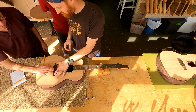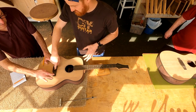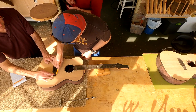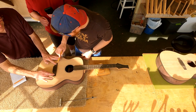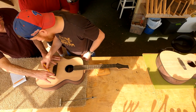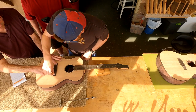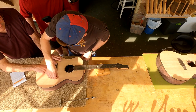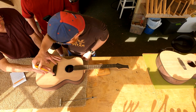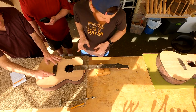And go ahead and hold it at the wings now. Like that. It's just a more stable way of holding that. And before I clamp this in place and drill through the E-string holes to set our location, I'm going to gently trace it, so that if it shifts slightly in this process, which it shouldn't, I'll know it because I'll see that it's now off its marks. So good, and keep holding that.